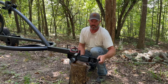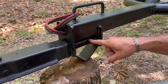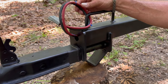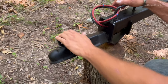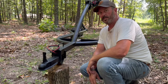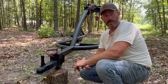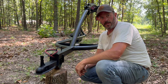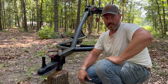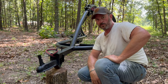So what we did here is create a swiveling tongue — this is greasable, here's your grease zert. This is a one-inch Grade 8 shaft that passes all the way through DOM tubing that's quarter-wall thickness with three-eighths here in the gusset plate. You can see you have a handle and then your power wire that runs your winch and connects to the back of your four-wheeler. That takes the safety factor up a lot. In the initial phases and testing I was doing some radical and dumb stuff — driving as fast as I could and trying to flip my trailer. I was never actually successful, but it's possible, and there are guys out there who'll take bigger chances than me. This is for that oh-shit factor and should keep you out of harm's way.